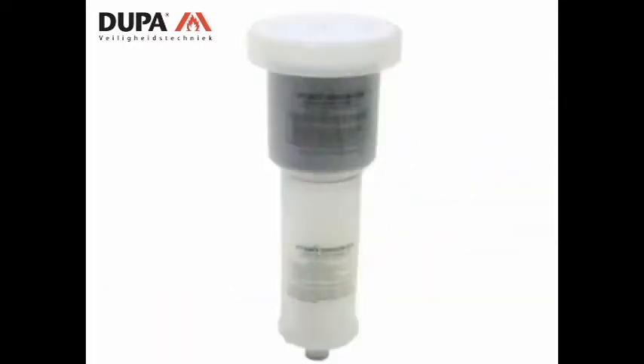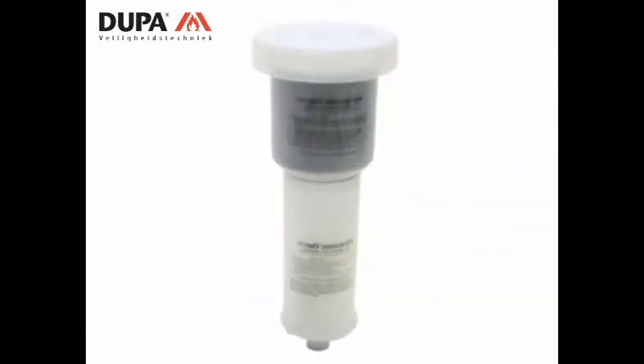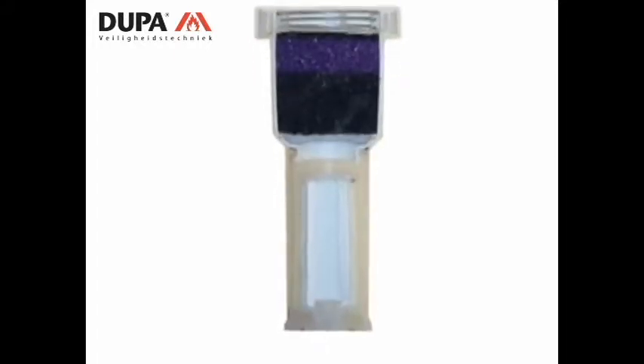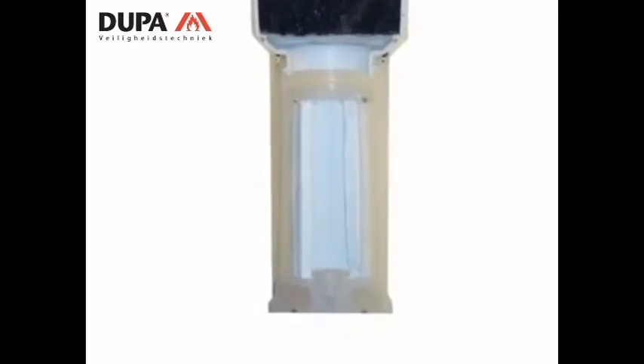Effective in filtering and collecting volatile organic compounds, or VOCs, the combination filter is comprised of two parts. The lower section is a coalescing cartridge that collects microscopic liquids from the can's propellant, which can then be drained back into the drum.